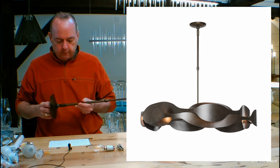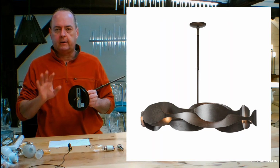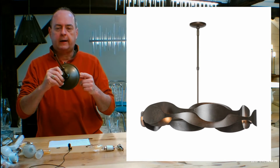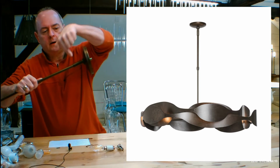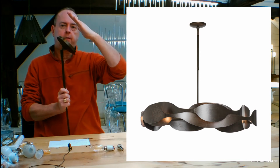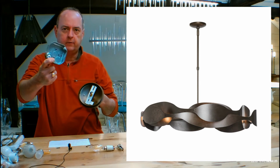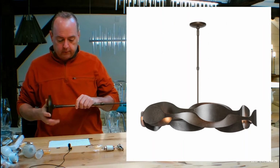So, moving on from there, let's talk about the canopy on this. And those drawings I talked about, the installation instructions, is going to show you the 5.25 inch round canopy. It is slope ceiling adaptable to 45 degrees. Has a knuckle right here. You can barely see it. And see how that tilts like that? So let's say this is your slope. It's going to go right on here. This is going to go onto a standard 4-inch junction box. This is what you guys have in your ceilings already. It's going to fit on there just beautifully. And that kind of takes care of the adjustable ranges.